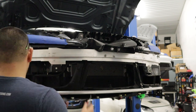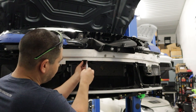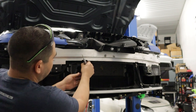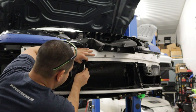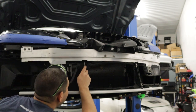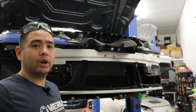Next, I used my center punch — hold this up on your mark. You want to just kind of take your center punch and scribe a little circle, and then you'll have a mark on the bottom of the crash bar to which you can center punch. Once you've got your center punch, we're going to start the drilling process.